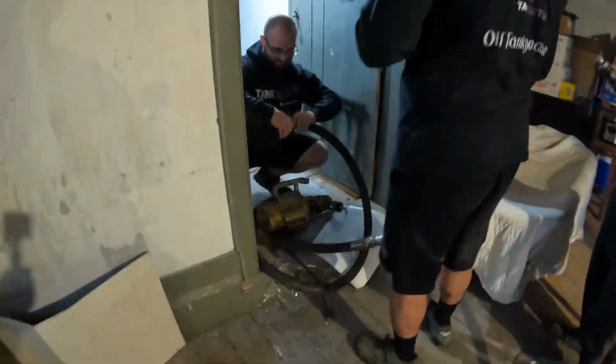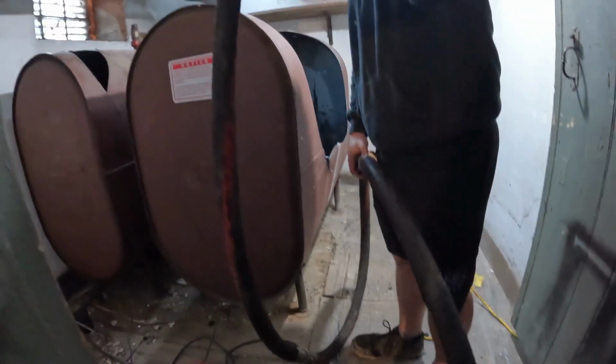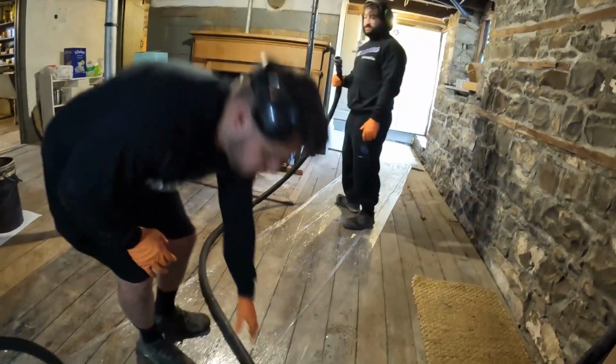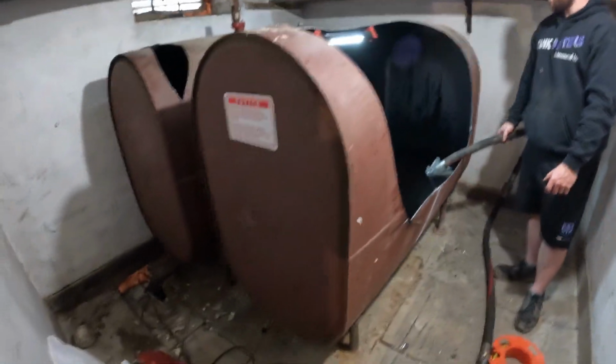All right, put a screen on the end of the hose. We're setting the hoses up now. Anytime you run hose through a home, it always worries me, but make extra precautions. We put a pad under every connection. We try to use the 50 footer. That's the longest one we have, right? 50 feet? That's not 50. Oh, 50, okay. A 50 footer's on the ground. Try not to have any connections inside the home. And we'll pump a little more than what we thought was going to be in it.